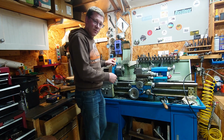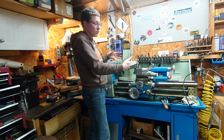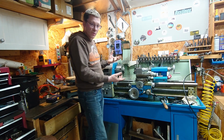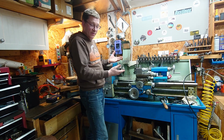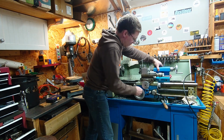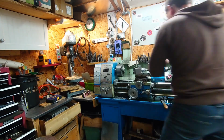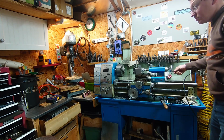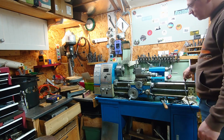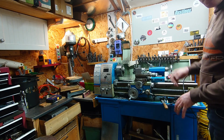So that when you're doing repetitive pecking operations with a drill, like a deep hole or something, we have to keep coming back out to clear chips and so on, or to get coolant in there or whatever, it's a lot more convenient to wind the handle backwards and forwards, the big handle, rather than doing this all the time. A lot quicker. So I'm going to see what I've got and knock one of those up.